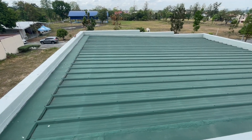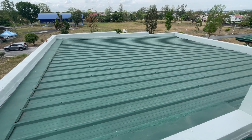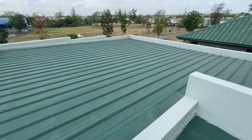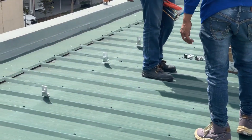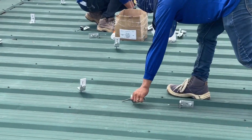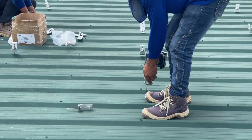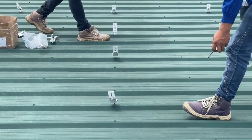This is our roof right before the installation. It was a good thing that our roof was relatively flat and had no adjacent structures or trees to cast shadows upon the panels. The first order of business was to attach the aluminum footings to the roof with tech screws. Some of the crew were drilling them halfway while some were putting sealant on them before they were screwed all the way in, to make sure that no rainwater will get in.